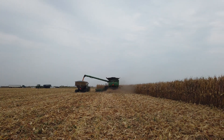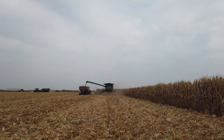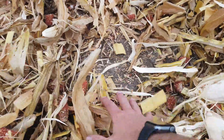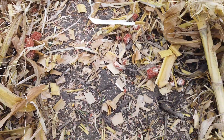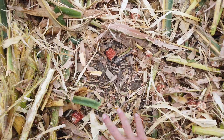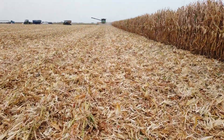If we take a look at the losses behind the machine, that's where the other big story comes in. Having the additional cleaning surface area that the X9 Combine has, we can do a really good job separating and cleaning the residue. If we come take a look at the stalks and clear away a little bit of space — there I see one kernel, and that's all I'm seeing there. This combine does a really, really nice job separating all the material out. Again, we're between about 21% and 25% moisture on this corn.